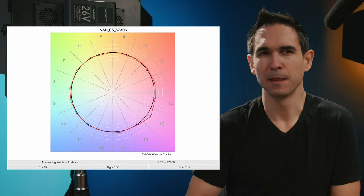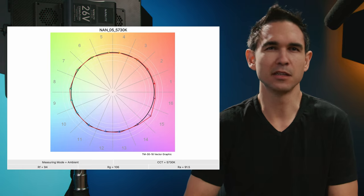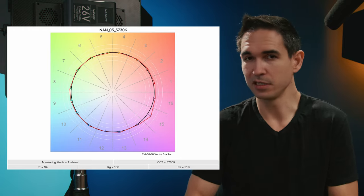But there's always a little bit of a green shift. The problem is that the green and magenta shift doesn't really work all that well on this light, particularly at the lower intensity levels. You could easily just white balance your camera with a grey card after setting up your light if this was your key light, and the green and magenta shift might not be an issue for you — even less so if you're using several mix panels together. But when you're matching this panel with other lights that you already have, you'll probably need gels to get this fixture to match, which sort of defeats the purpose of owning an RGBWW panel. Now it might be a non-issue if you're using this light in a creative capacity for its full color options, because at that point the green shift is no longer a consideration.